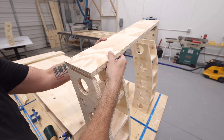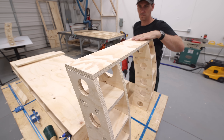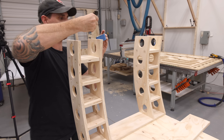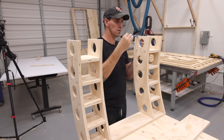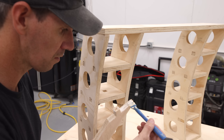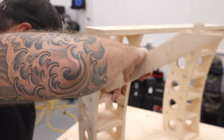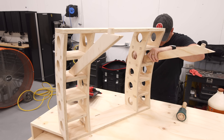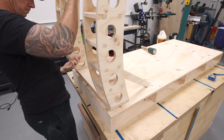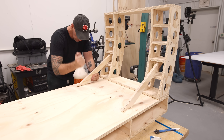For the top and bottom of the legs, I added a board that spans between the two legs and connects them into one piece — a slight modification from my original design meant to prevent any side-to-side racking. The 45-degree support also slots into the spacer with a slot cut into the number two spacer, with the other side connecting to a slot on the underside of the workbench. I also added a few brad nails to help hold everything together while the glue dries.